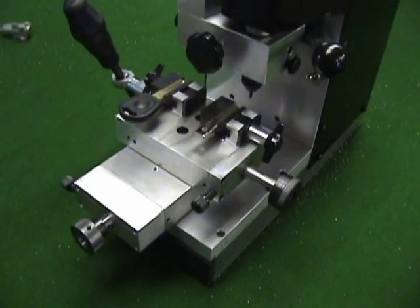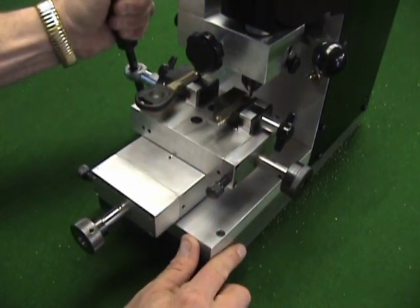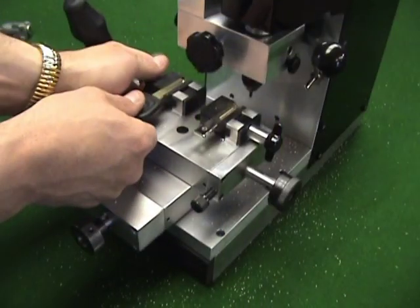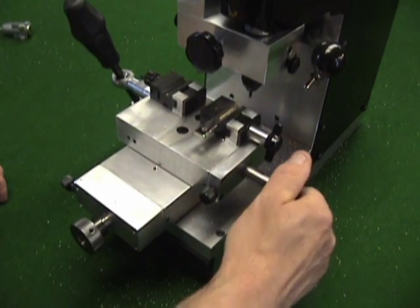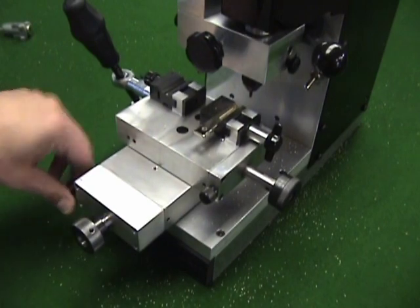To start cutting a Volkswagen key, we will trace the number 1 cuts onto our blank, set the proper depth for the cut, and clear out our tip cuts. Insert the setup key into the left vise and set the cutter depth for duplicating as covered earlier. Insert the blank into the right vise and copy the setup key onto the blank — repeat this for both sides of the key. We now have a Volkswagen key with number 1 cuts on both sides and the proper tip cut. Remove the setup key from the machine. Next, engage the depth and space rods: tighten both thumbscrews completely, then back them off about one half turn. Rotate the depth and space rods until you feel each stop engage — you will see and feel the carriage snap from one depth or space to the next.